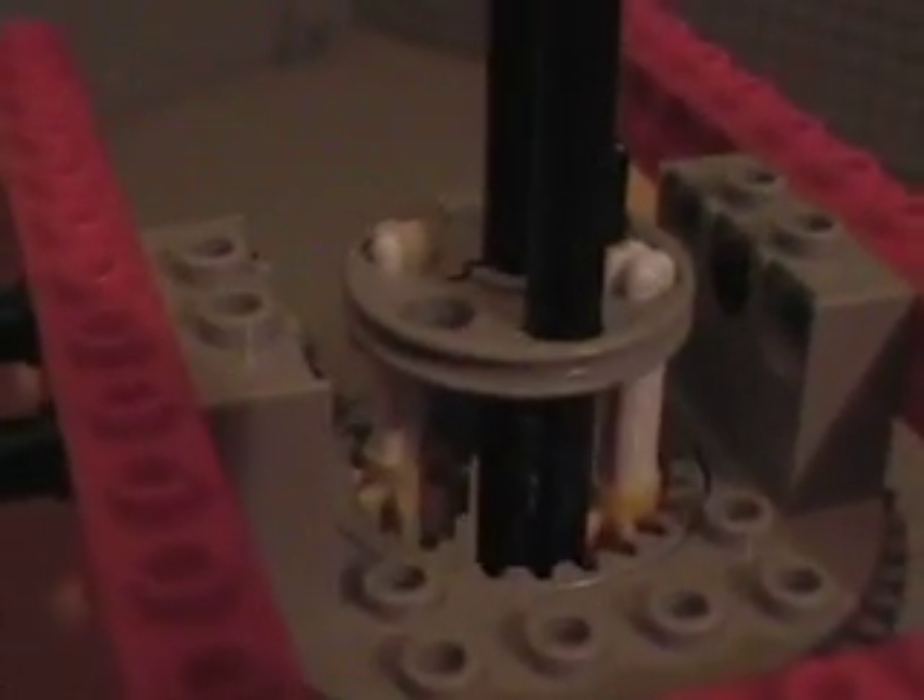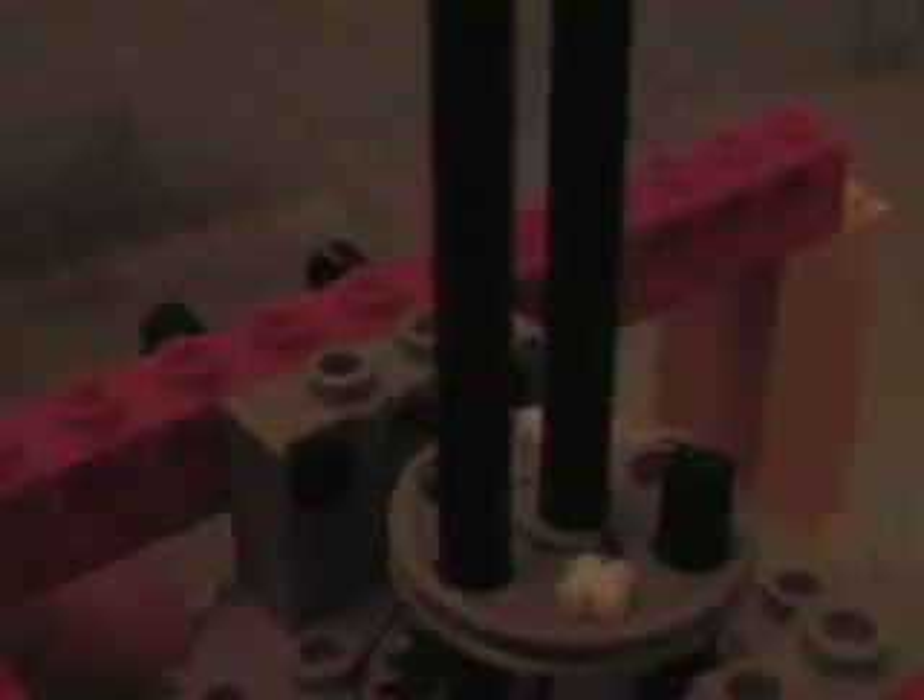To make it go, we need two parallel shafts located at opposite sides. This Lego wheel here — the little tire hub that has seven holes in it, normally used as a tire hub — allows us to have six shafts, that is three pairs, plus a seventh shaft in the middle. I've only populated this with a total of five shafts: four rotators and one center support shaft, with two holes left open. But the idea is that you would have three pairs of shafts, as these other black shafts represent.